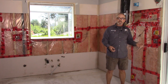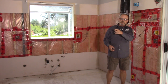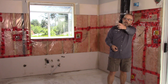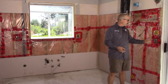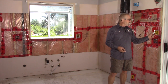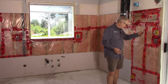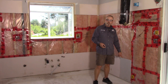This three-wire was fished over from the other location to create a three-way switch network to control the lighting in the main kitchen area. Before, it was only switched from one end, so if you came in from the patio in the evening, the closest light switch for the kitchen was all the way across the room — which is not good. It always should have been a three-way network. This other switch here is for the outside patio wall sconce.